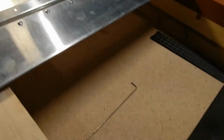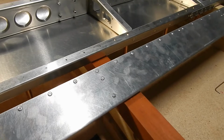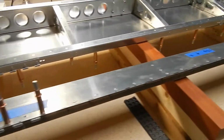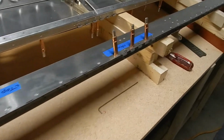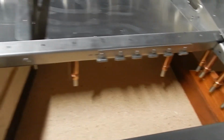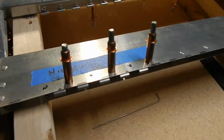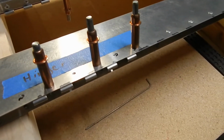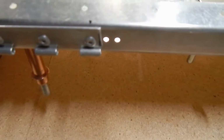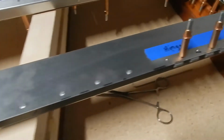Then I've already removed the pins. The pins are down here. And as I pull the trim tab away from the hinge and flip it over, you can see that I've got the hinges clecoed to the trim tab. I just finished riveting the hinge brace to the strut, and now I'm going to rivet to the trim tab, and then it says to tie down, drill the little counter holes, and tie down the hinge pin with some tie wire, and I'll cover that in just a second. But let me get these riveted, and then we'll work on the tie wire.